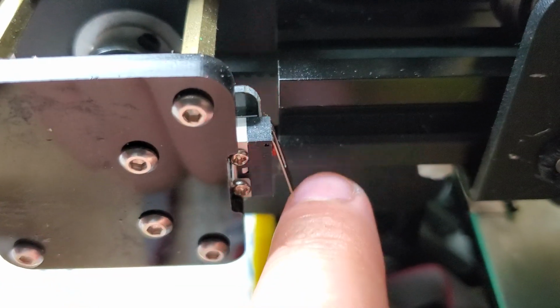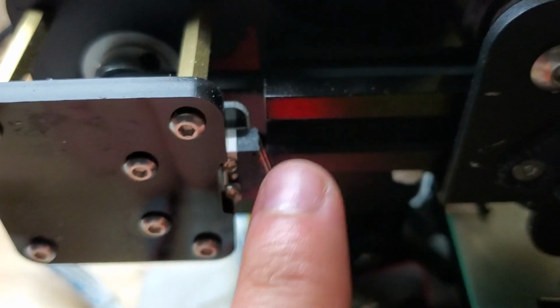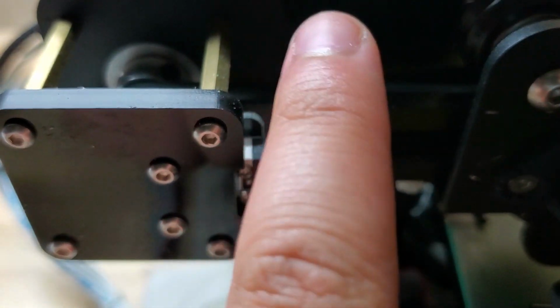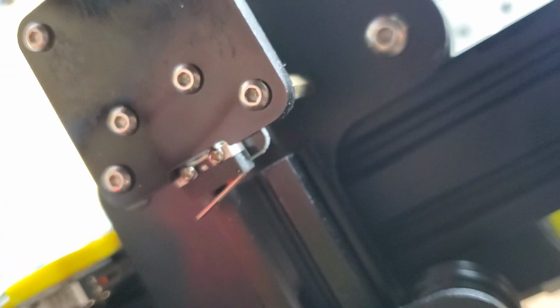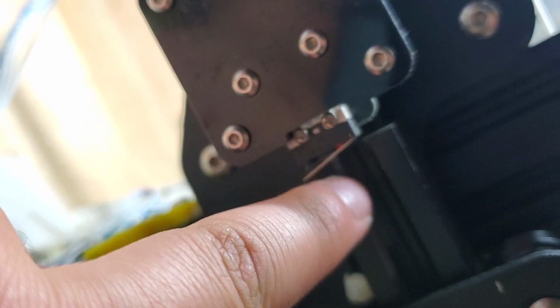And so what they have on them is a little wheel, and if you can imagine the track is going this way, and we're looking at it from the side, it'll move with it, and once it gets to something, it'll have a little hill, and it'll click it. So then that will be connected to the little computer, and there'll be a tiny little hill that'll push the end stop, or a little momentary switch, so that it can tell where it is.